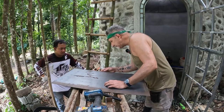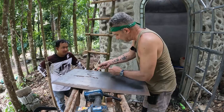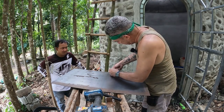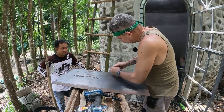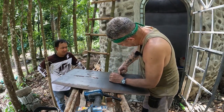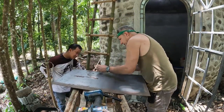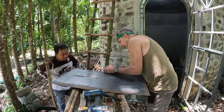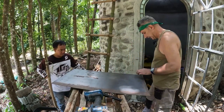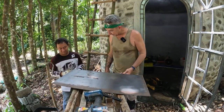It does pretty good as long as you don't stop, but sometimes it's hard not to stop. When you're going, watch because when you get down here you tend to tilt — that head has to stay flat. When you angle it you get a rough cut, so concentrate on keeping the cutting head parallel to the piece. But it's pretty cool — saves a huge amount of time.